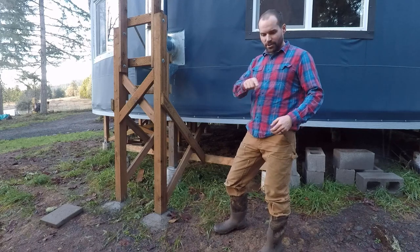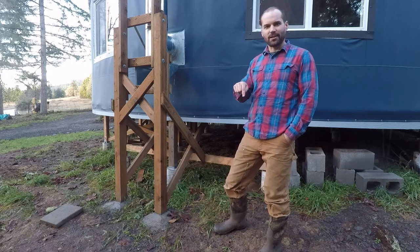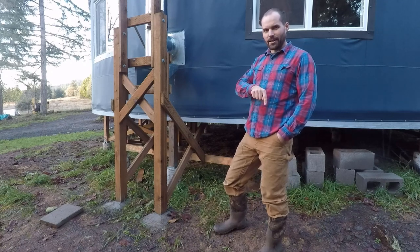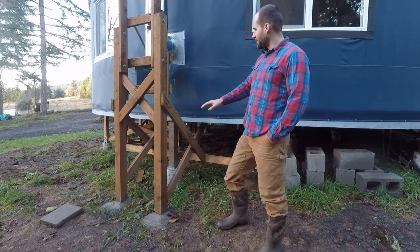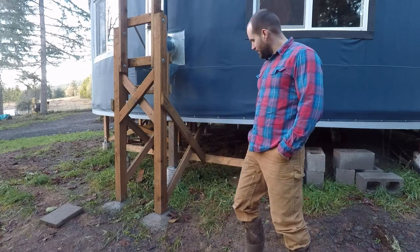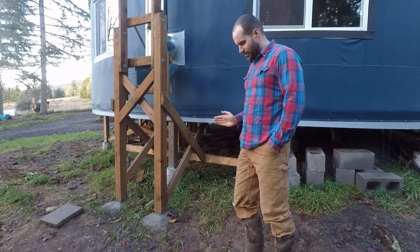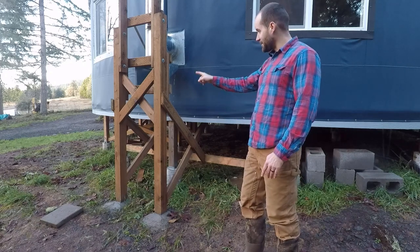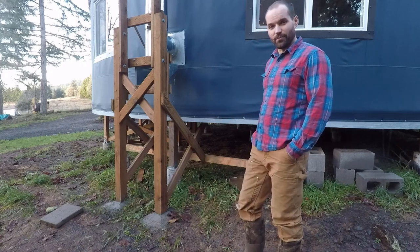The inside of our yurt, when you get a yurt and you choose the placement of your doors and stuff, you use kind of clock language. Like, we've got our front door at 6 o'clock, our utility room door at 9 o'clock, our bed and bedroom window are at 12 o'clock, and our wood stove comes out at exactly 3 o'clock. And what that meant was that we were able to interact really well with the foundation. It turned out to be just right to work orthogonally with those 4x6 beams to our posts, allowed us to tie into it in this way and make it really strong. So I'm really pleased with that.